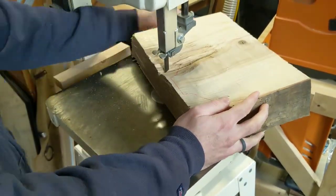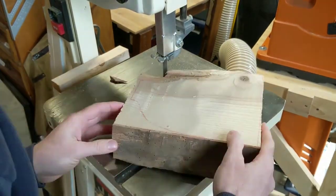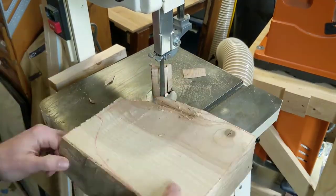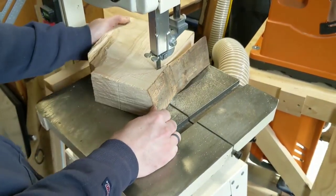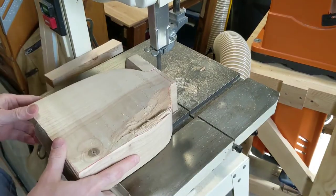What I'm doing here is cutting out the rough shape in a piece of ash that's about 2 inches thick, maybe a little thicker. That's a piece of wood from my property that I had cut down and then split out of a larger log. The neat thing about this vase is that you don't need a lathe to make it, but you can get some really unique shapes by roughing it out on the bandsaw and then doing some carving and sanding.